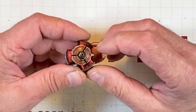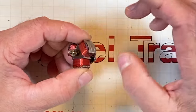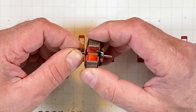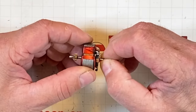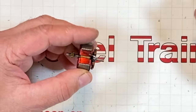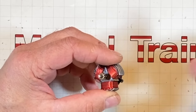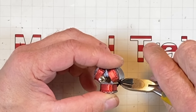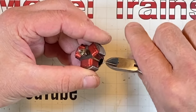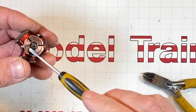I decided I'm going to take it completely apart - I've always wanted to rewind one of these. We're going to rewind it, take this off, get this glued onto the shaft better so this stops happening, and then rewind the motor up. The real key is making sure you've got the exact same number of winds on each one of these poles, and also the way these three are on there and how they're soldered down underneath.